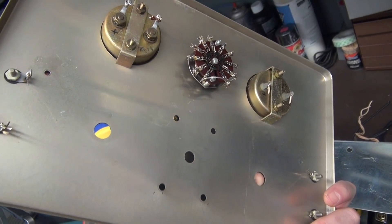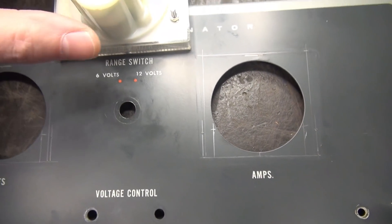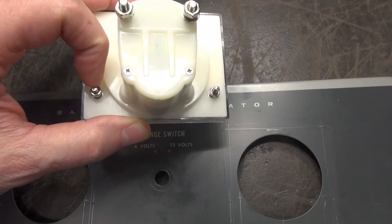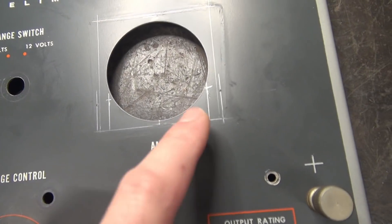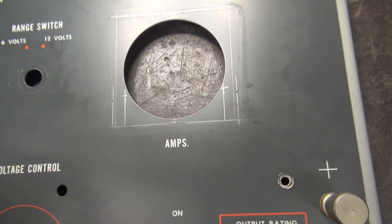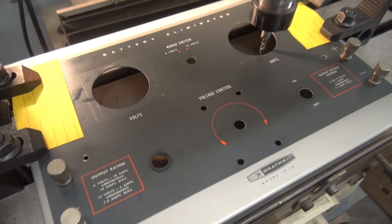All the hardware has been removed and the front panel easily pops off — ready for modification. I just need to remove these other components and get the layout for the new meters. There's my pattern. I'm going to mill out to clear the base of the new meter. This diameter right here is about 60 millimeters, and then you have the two studs sticking out to mount it to the face. I've got those center punched, so I'm going to mill and swoop out around those mounting holes so we have enough meat on the panel for the meters to mount.